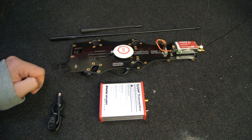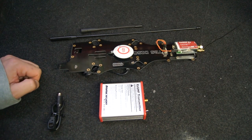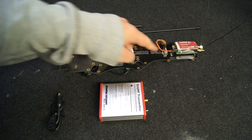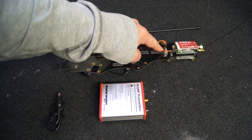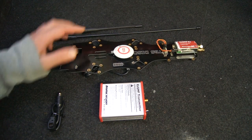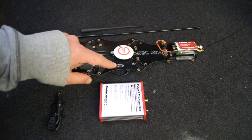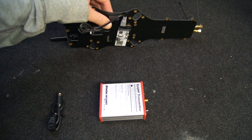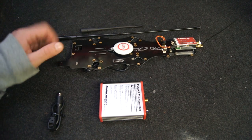Let's get all the physical out of the way. The first thing you're going to need to do is install your receiver on the top plate of your TBS Discovery or other quadcopter. I've used a single cable here from channel 1 and looped it round into channel 1 on my servo prongs, which I've installed on my top plate of the TBS. All this does is carry the signals inside the board itself to the plate, so you can then have another servo cable come out and go into the NAZA. This just makes the whole quadcopter look a bit neater.